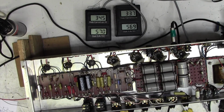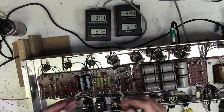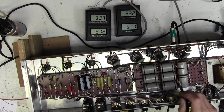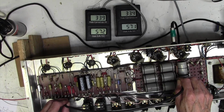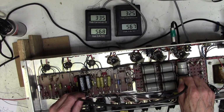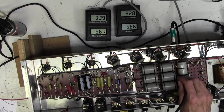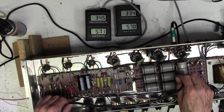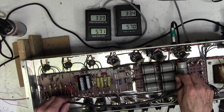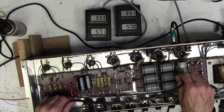Well, you would hardly believe this, and I can hardly believe my eyes here. I've made a bit of a shorter length. That was a bit of a huge cable, that one. So we've got a real decent chunk of cable here. From my star earth to this part of the solder tag, no hum reduction. To here, no hum reduction. Kind of what I'd expect. We've already got a great big thick cable going from here to here. Watch this though. That's killed the hum completely. That is now absolutely hum free. Whereas there, nothing. No change. Absolutely bonkers.